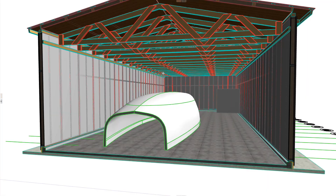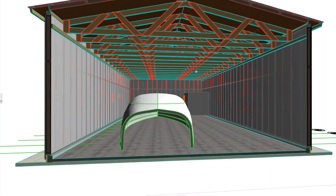In that way there will be space for a small office, toilet, and some utility room — for example, I'd really like to put the dust collection in a separate room to reduce noise levels. For height, there should be around 4 meters of free space. The boat height from the bottom of the keel to the top of the roof will be about 3.5 meters. One particular feature the shed needs is the ability to easily open one end to get the boat in and out.